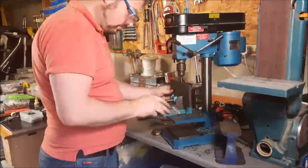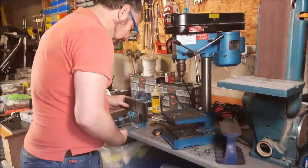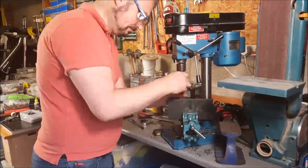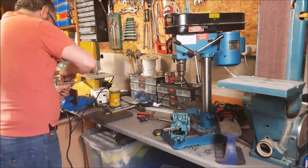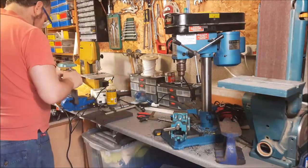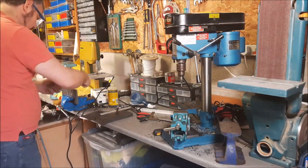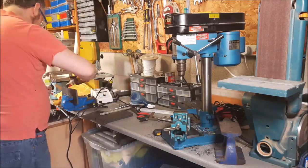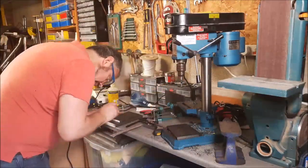So what have we got here? I'm basically going to go through and make up a bracket for the platter support. Very similar process to last time around — looking at some 100mm by 200mm, 10mm steel plate. I'll drill some holes in the tops, tap them, and then secure some plates to tie onto the platter arm. As you can see, lots of tapping and generally trying to figure things out.